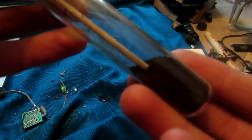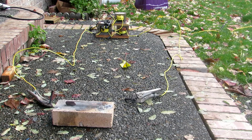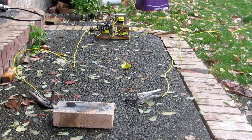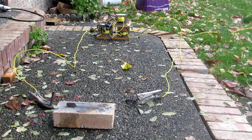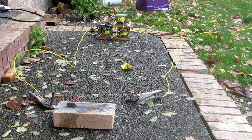I've set up my arc furnace outside and we have the test tube of our cobalt compound. I'm not sure if it's the powdered metal or the oxide, but we'll be melting it. Upon adding huge amounts of heat from the arc furnace — though you just need about 1,000 degrees Celsius — if this is cobalt oxide, all the cobalt oxides will convert to cobalt(II) oxide (CoO). This is necessary because if we need to reduce it with aluminum later, it should be cobalt(II) oxide, not the other oxides, as cobalt(II) oxide is the most efficient to reduce to cobalt metal and will leave the fewest byproducts. If it is cobalt metal, it'll just melt into a nice bead. We'll pour a little out, melt it, and see what we get.